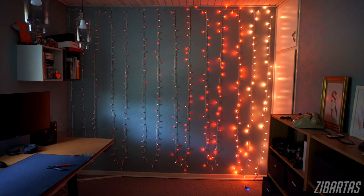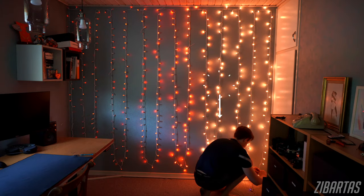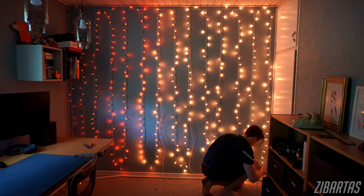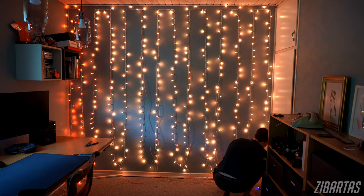This phenomenon is called voltage drop, and I just wanted to show you guys how to deal with it. Basically, our circuit is so long that the voltage falls off below useful levels. To solve this, we need to add additional power wires to different parts of the circuit, straight from the power supply. It's working. You got physics. By running so many dedicated power lines, we'll be able to max out the brightness and really push this already to its limits.